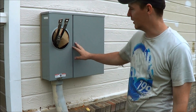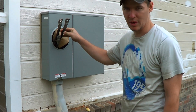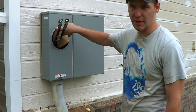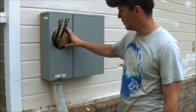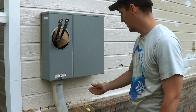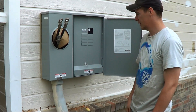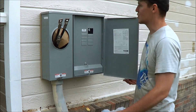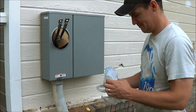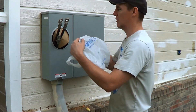We've got our finished meter base put in now. I just left these wires out — this is for the utility company to hook up to. They're going to hook up to these top lugs where the meter goes, and then they're going to put in the meter. I've already hooked into those bottom lugs which goes over to our panel side, so everything over here is all good. I've got this cover on and we're good to go. I just put this bag over it just in case we don't get water leaking down into this pipe here.